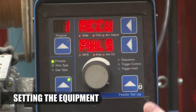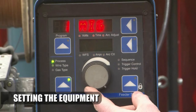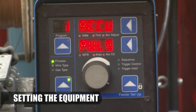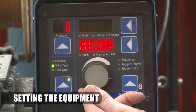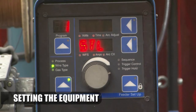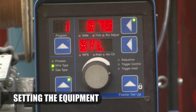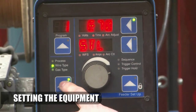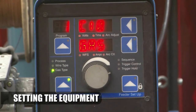Next, we use our process setup button to decide which process we want to weld with. There's a straight MIG program and several different ones. I'm going to go with AccuPulse, which is a pulse spray program. It then asks what type of wire you're welding with — steel, aluminum, metal core, or stainless steel. We're welding with steel wire. It'll ask the tensile strength of the wire — ER70S6, so 70,000 pounds per square inch. The diameter of the wire is .035, and we are using a C10 gas. Once we've adjusted our gas flow, wire feed speed, and heat reference number, the next thing I always do is check the gun.